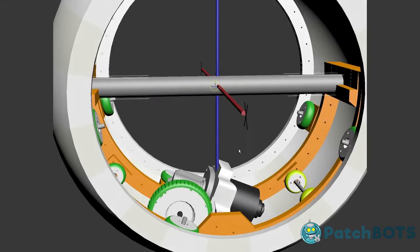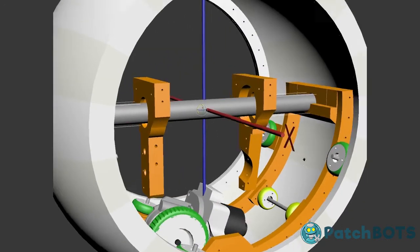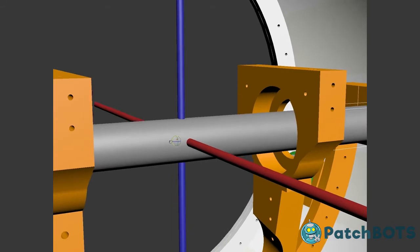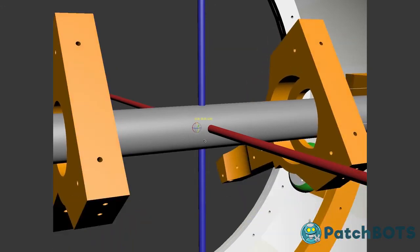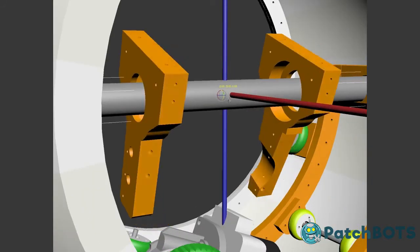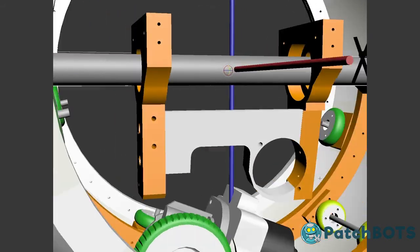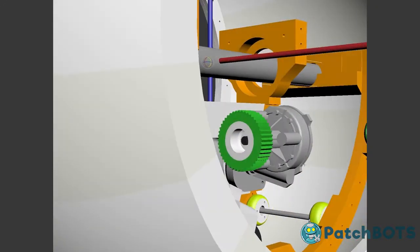These names are all patented by James Bruton himself. The trousers look like this. These guys have bearings in these big recesses. I didn't model the bearings, but these things will hang on this axis, and it'll rotate just like this. Now, the purpose of these trousers is to give us side-to-side mobility along the y-axis. So how we're going to do that is printing another motor mount here, which will attach to the trousers, which will obviously hold another motor.